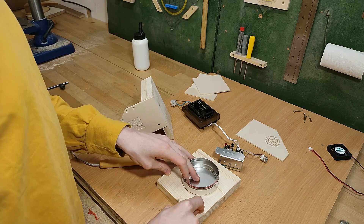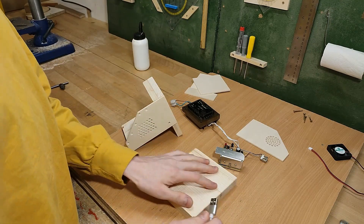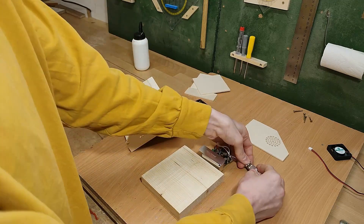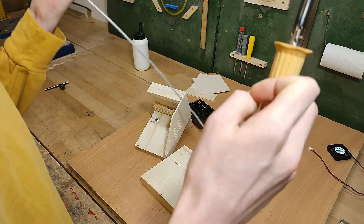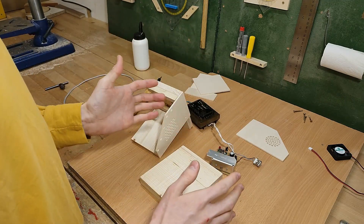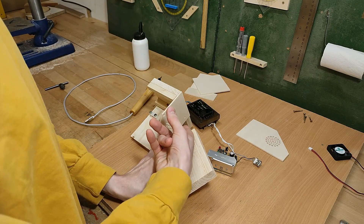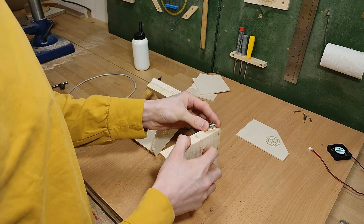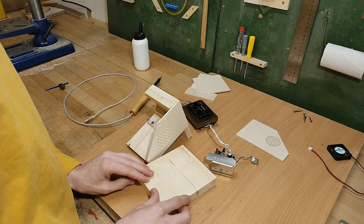This is going to be cut off at an angle, and the reason for this hole is because I decided the most convenient spot to put the USB port for plugging the soldering iron into was going to be the right side of the soldering station, since putting it on the left side and being right-handed doesn't make any sense. But this is basically the most inconvenient spot in terms of cable management and fabrication, because it means I need to drill a hole all the way through this board lengthwise and then route out a little pocket for the USB port to sit into. It's definitely not a very conventional way of doing it, but that doesn't really stop me from doing it anyway.